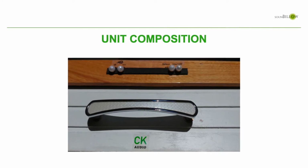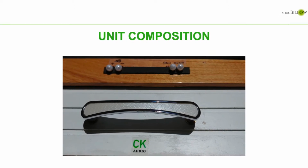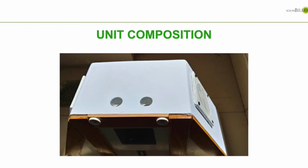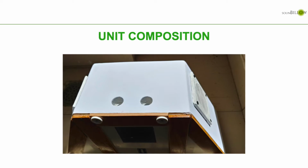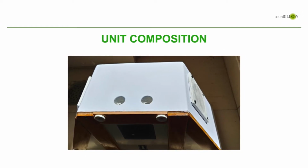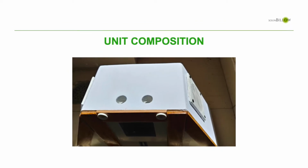panel sturdiness. Selection buttons are clung to the top panel, with which the tactile buttons are pushed onto the amplifier board inside. Round pearl-like plastic beads are attached to the pillar heads, which directly align to the tactile button heads for pushing.